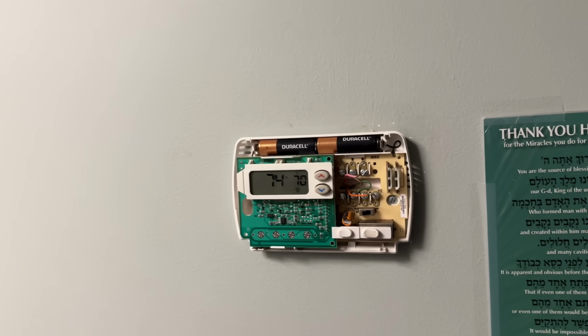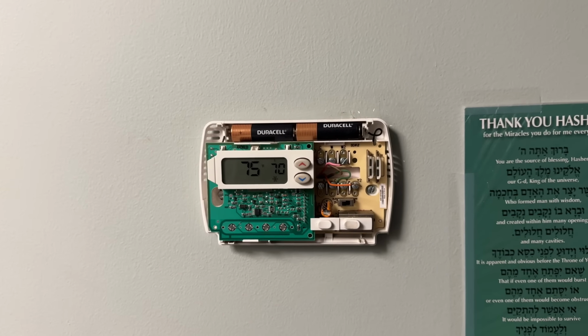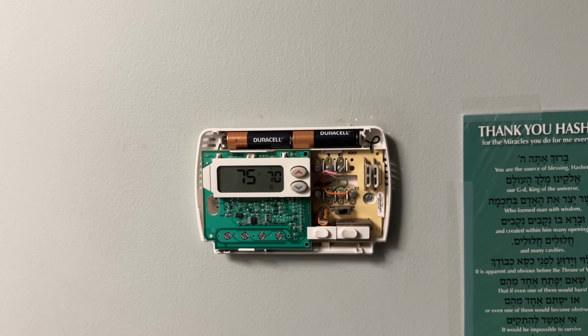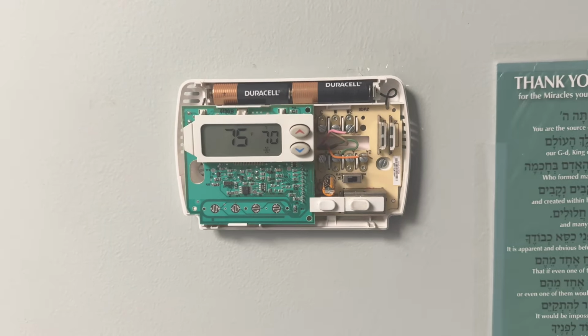Now I did check the condensate pump there. The end switch is not wired to anything, so that's not breaking a circuit. There's no float switches on the drain line, so something's breaking. Why?